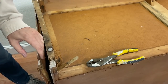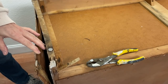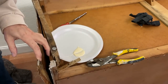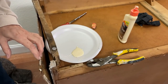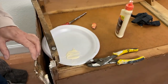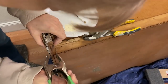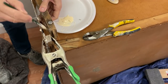As you can see, this dresser has a lot of damage. Since you should allow wood glue to dry a full 24 hours, I chose to tackle those areas first. Once I flipped the dresser over, I was able to examine the full extent of the damage to the bottom. The groove in this tongue and groove joint is broken, and the veneer has pulled away from the body of the dresser and its base. Wood glue was applied to both sides of these areas needing repair, and this was the first of many clamps I used to restore this dresser.